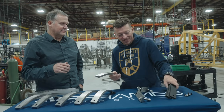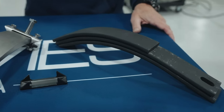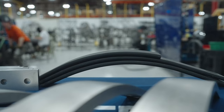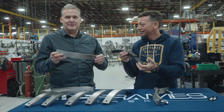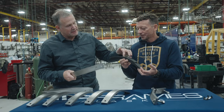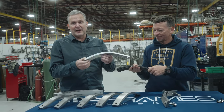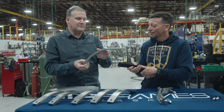To help you I brought an old tail spring. The most obvious thing is this is steel, this is titanium — it's a three-pound weight reduction. And also this is a leaf spring with three leaves. This is a single billet wire EDM titanium tail spring.